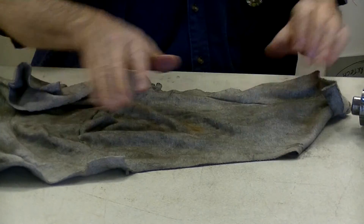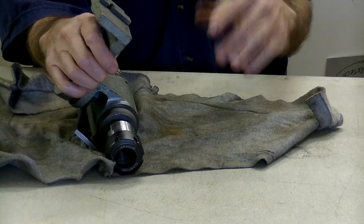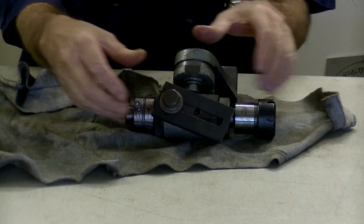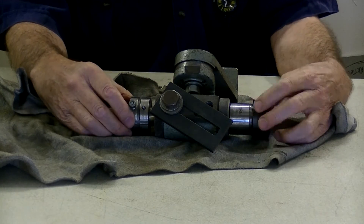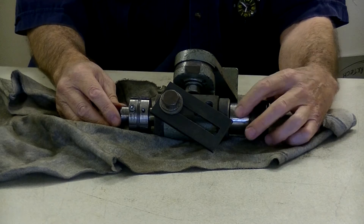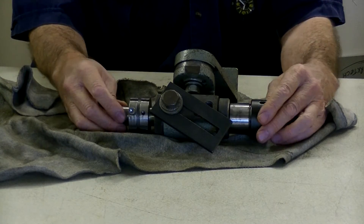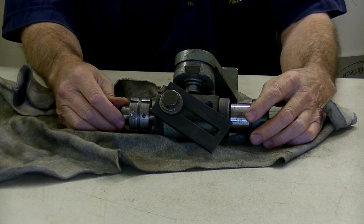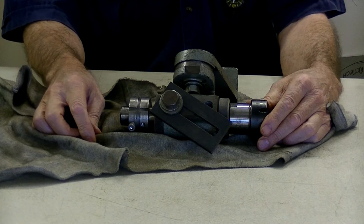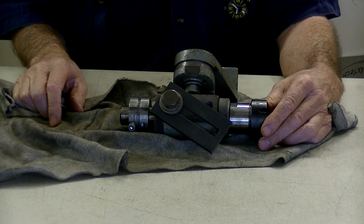This is the Clarkson workhead for the tool and cutter grinder. These plates were originally slotted out to go on the base so I could use it at angles other than dropping it into the table slot — makes it a little bit more universal. Standard Clarkson workhead with metric bushes. This is an ER32 collet chuck with a 25mm shaft. If you're going to build a home-built tool and cutter grinder, I would suggest this would be the most universal item — the basic collet chuck cost me about $70. I also got an ER11 collet holder going up to 11mm with about 10 collets for $50 or $60, which I use for very small drills for four-facet and split point grinding.